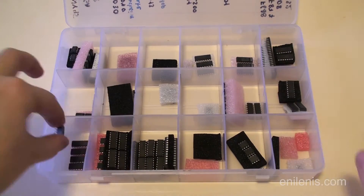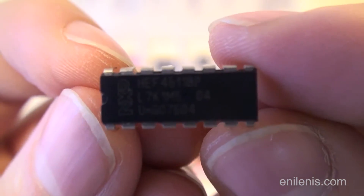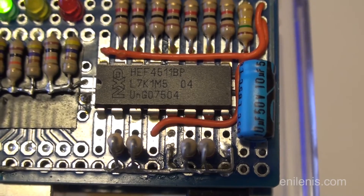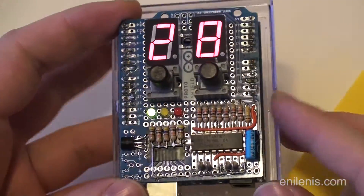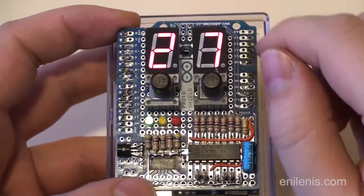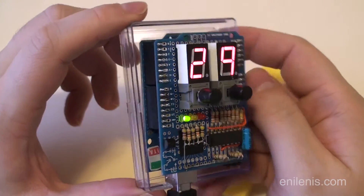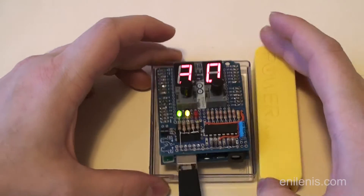How to solve the problem? With a multiplexer — more specifically, with a binary coded decimal to 7-segment converter, a microchip designed exclusively for 7-segment display operation. It uses 4 input lines and outputs 7. Right next to it you'll see an electrolytic capacitor. The purpose of it is to delay the operation of the digits by a few seconds while the Arduino board itself is booting up and establishes communication with the computer via USB. Without it, the display might show some junk characters. In addition, we're going to use a trick called persistence of vision: we're not actually going to light up both digits at the same time, but alternate between them roughly every 2 milliseconds — too fast for the human eye to catch, and even for the video camera. As a result, both digits will appear to be lit at the same time. Those 4 input lines are going to give us an equivalent of 14 outputs, but we still have to add 2 more pins to alternate between the common cathodes of the 7-segment displays.